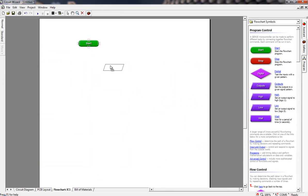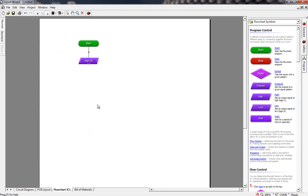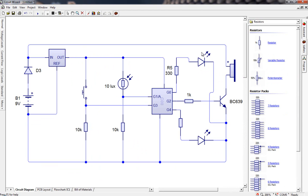So there's my start shape — output, double-click, output 0 to be turned on. Now let's think about the circuit a bit more. What I want next is to have nothing happen until I push and hold down this button for about three seconds. I don't want to accidentally knock it and set the alarm off, so I want to make sure I've held the button down for about three seconds, and then we'll start to arm the alarm. That button is plugged into input number three.